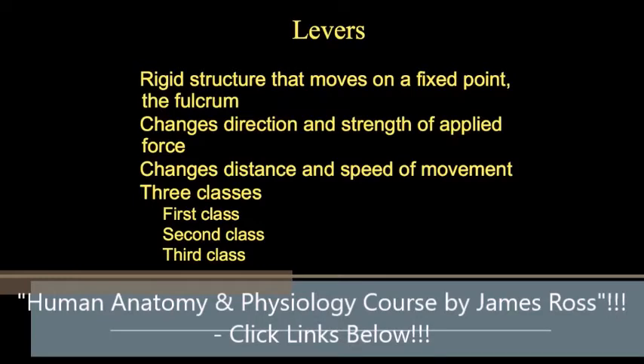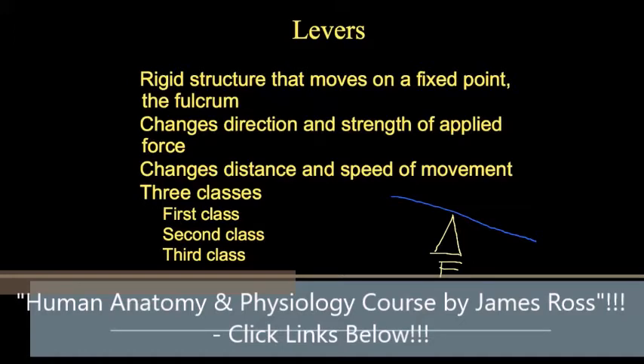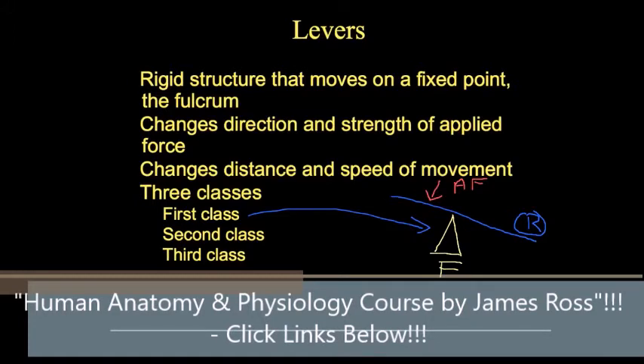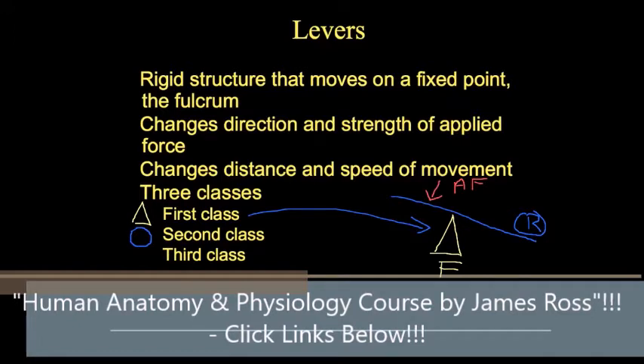When it comes to levers, remember the idea of a lever: we have a fulcrum, the lever arm itself, and on one end an applied force — a push of some kind — and on the other end a resistance. A typical lever of this sort acts like a teeter-totter and is a first class lever. The difference between each type is what's in the middle: in a first class lever it's the fulcrum, in a second class lever it's the resistance, and in a third class lever it's the applied force.